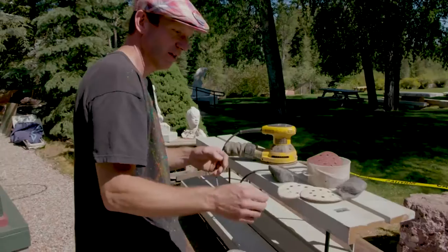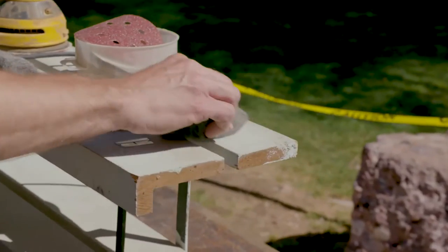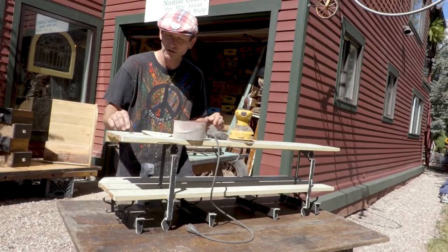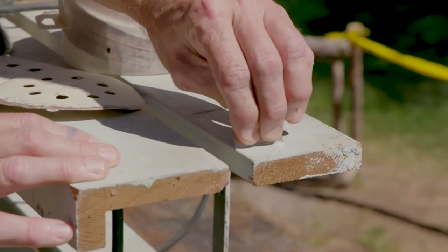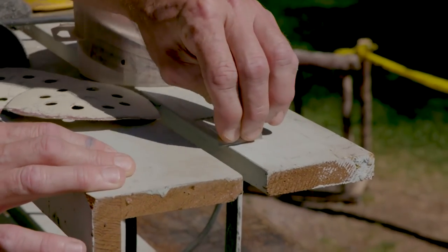One method: if the paint is peeling a little, you can use steel wool to get the paint to come off and see the layers underneath. If that's not doing the trick and you don't want to use that much elbow grease, you can get the razor blade out and start scraping. That will give you a pretty quick idea of what's underneath.